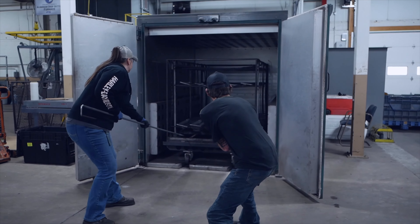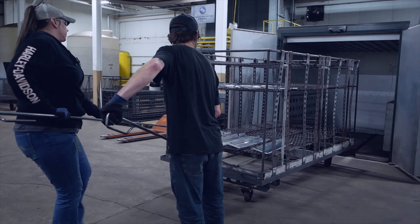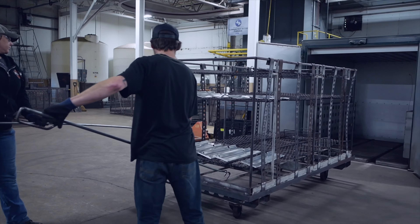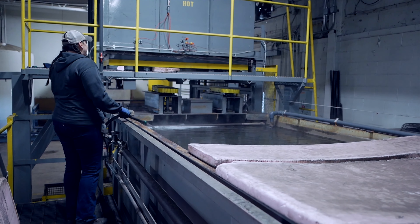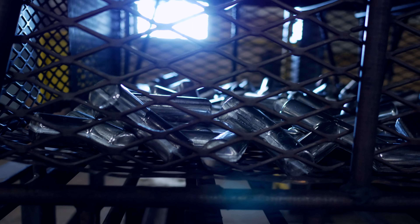The reason we got into this was because aerospace, when it gets busy, sometimes the lead times can go out four weeks, eight weeks if it's really busy. And we just can't do that, especially in development, because we might have several iterations of a process and we might have up to three heat treats in one process. So to stretch out each heat treat by a month, it would take a year to develop a part. Having all of this here in our location and having it NADCAP approved, we can keep things going.